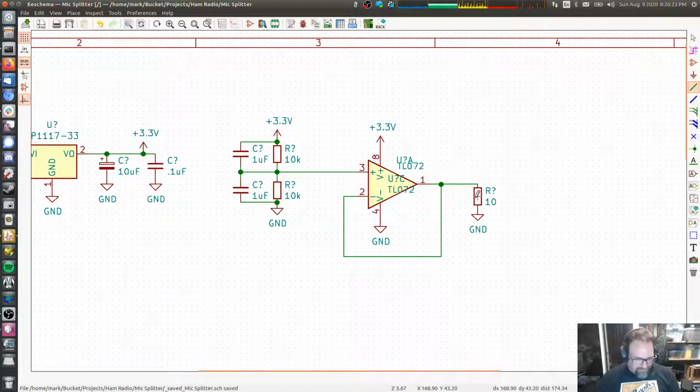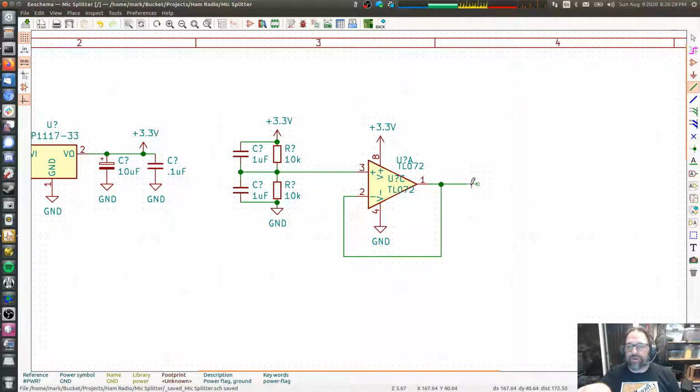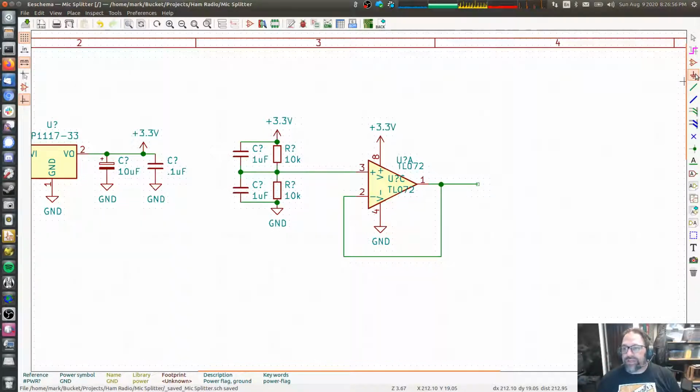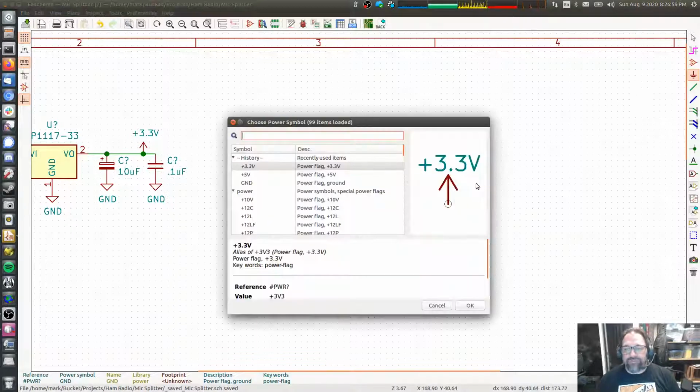So what we've basically done is we've created this line right here, which will be a super stable half VCC output. With 3.3 here, this becomes 1.65. If this were a 5 volt input, this would be 2.5 volts, right? Whatever your power supply input is, this creates a strong, solid, low impedance output that is halfway between it. And now we can use that halfway between our voltage rails as our false ground.